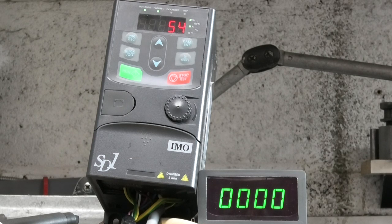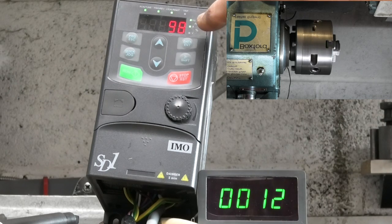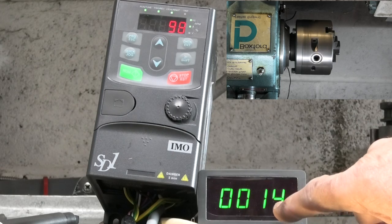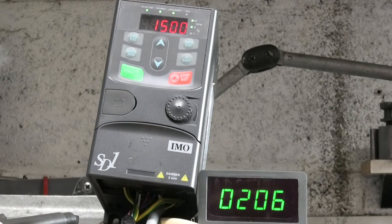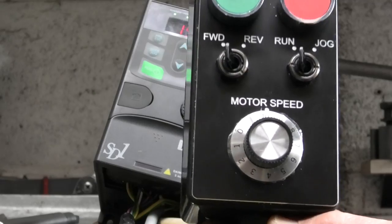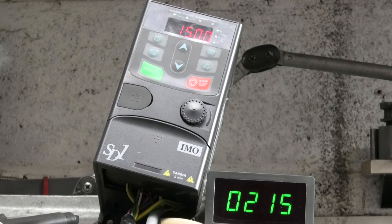I get a little squealing noise at the start — doesn't like that speed. That's running at about 12 revs per minute, and at the moment the motor is doing 98 RPM but the spindle is doing 14. It's still warming up — the lathe is really cold, only 9 degrees in the workshop. On full speed on the pendant, the motor is doing 1500 revs and the lathe is doing 216. When it was warm it was doing 229 RPM.